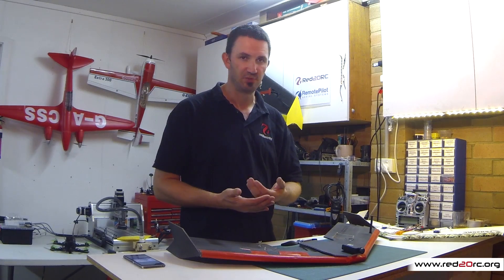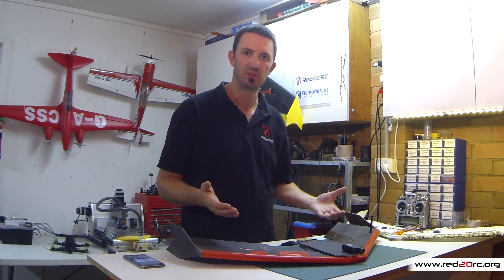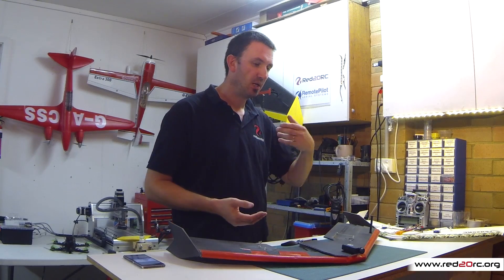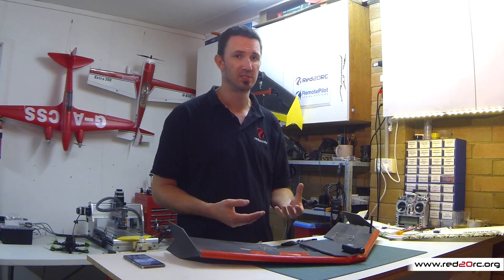So what do I think about it going forward? There are pros and cons. Obviously there's a problem with the 1,000mAh battery — it's only giving me five or six minutes of flight time, which even on a good day is barely going to give me a kilometre range. That's no good for actual UAV-type surveying work, especially if I'm going to put a bigger payload with a bigger camera on the bottom. And with this three-cell setup with a small prop, power was very marginal, particularly in the windy weather I was testing in. We almost needed full throttle to keep it up.